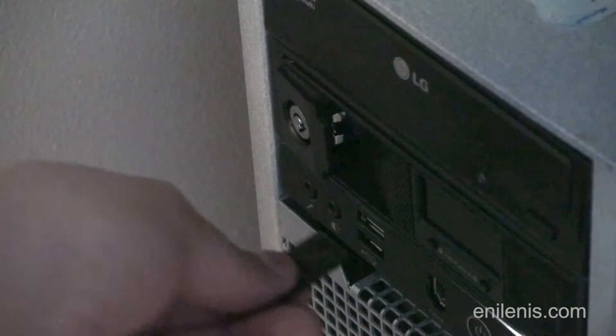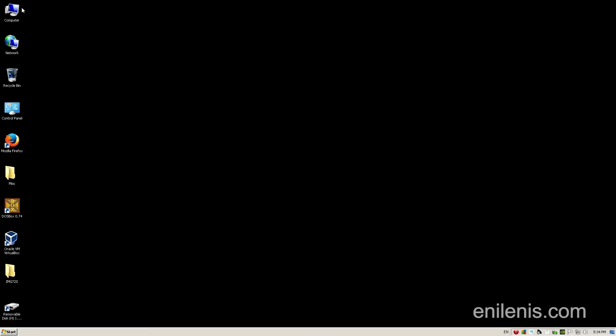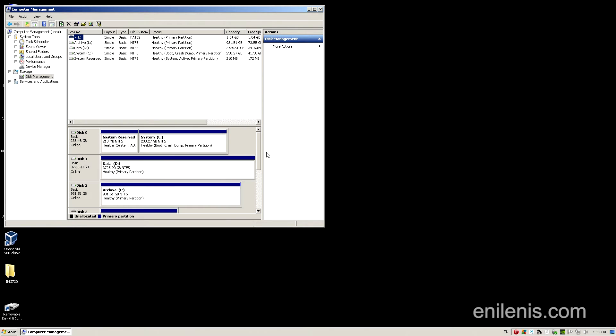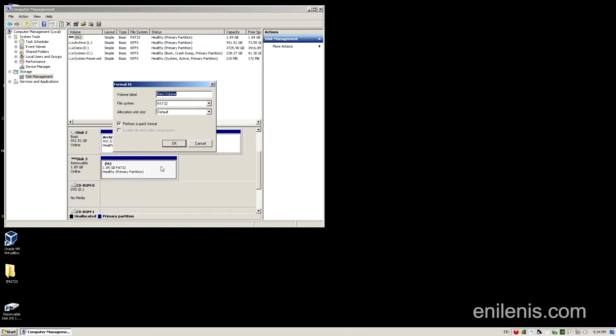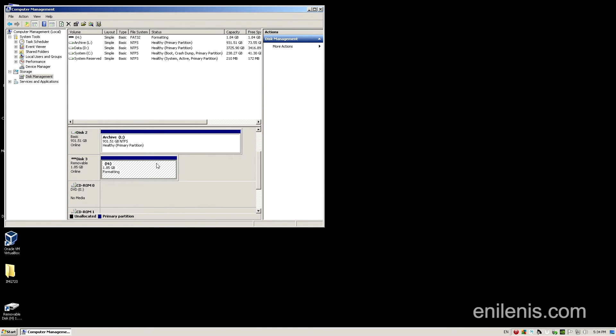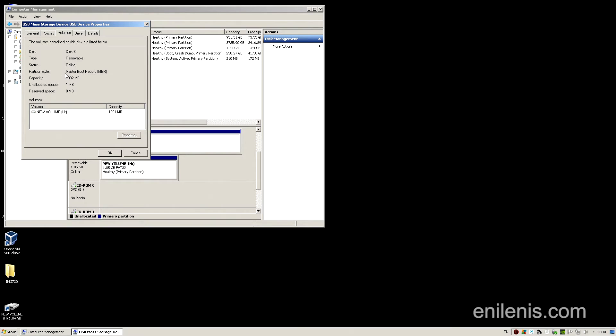This emulator is able to store up to 100 diskette images — not 1000 like some other revisions, but trust me, this is more than you will require in a lifetime. I will provide links to the most essential files; you can retrieve them off Roland's website or through the backup links in the description. All you have to do now is format the drive as a FAT32 partition through the Windows manager — that function can be accessed by right-clicking on the computer icon. After you're finished, make sure the stick is set with a master boot record, and then you will be ready to copy the files.